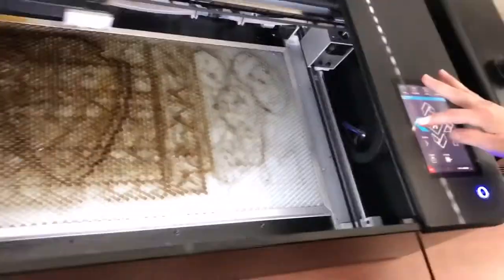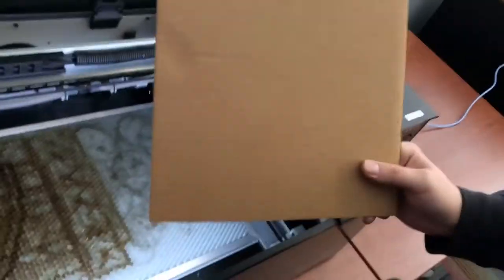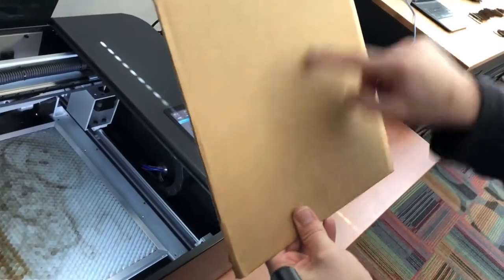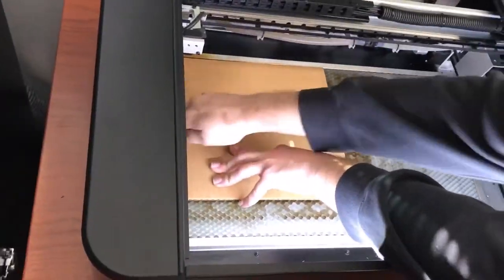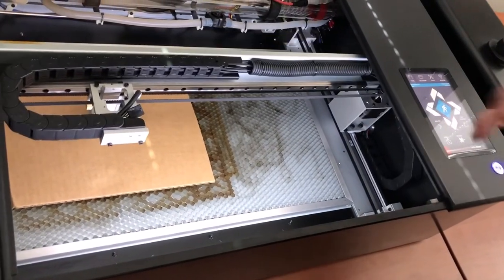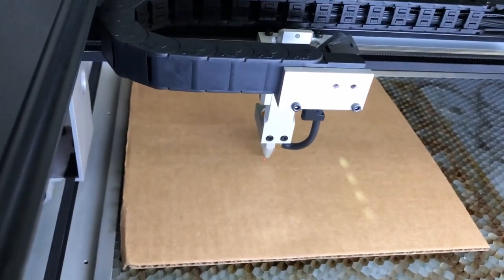In this case, cardboard. So once we have our design put into the computer, the laser cutter will know which shapes to cut out of the material. The first thing we do is lay the cardboard down and we want to make sure there are no raised edges. Next, we make sure the laser is distanced properly from the material for the correct height.